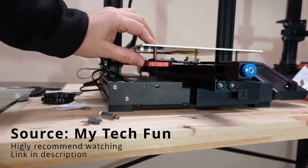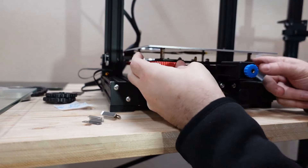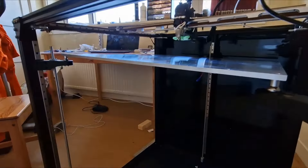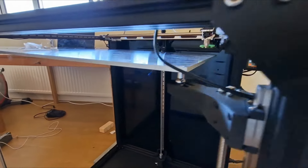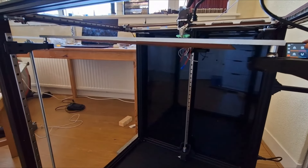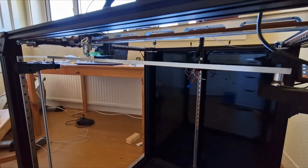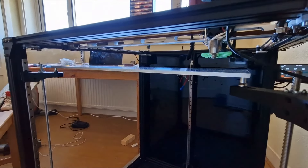The second problem is making sure the build surface is perfectly parallel to the printhead plane. The most common workaround is to have leveling knobs on the build plate corners, but those eventually go out of alignment. In my opinion, Kinematic Bed is the true MVP here. With the help of a distance sensor, it can automatically realign those planes as many times as you want, fully automatically, so you don't even have to move your butt out of the chair. It is expensive sure, but it does solve one very annoying problem — the more you disturb your build plate, the more you have to adjust these knobs.